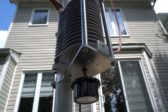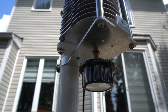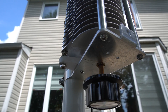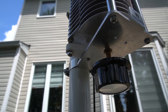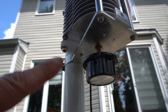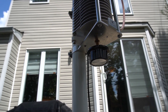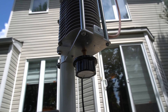Down here is the knob that you tune with — you add more or take away capacitance. The adjustments are very, very fine. Once you get closer to the frequency you want, if you want to move a little bit left or right it has to be a millimetric movement. A lot of people I've seen put a 12-volt electric motor in here and do the tuning wirelessly, and they help with the software. It helps quite a bit and cuts down a lot of time.